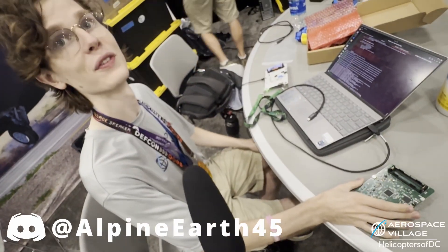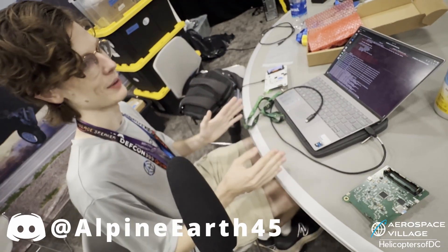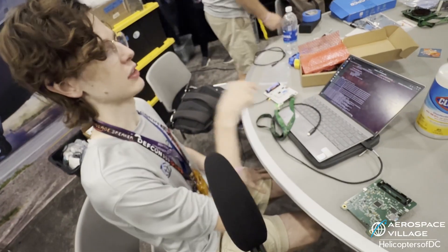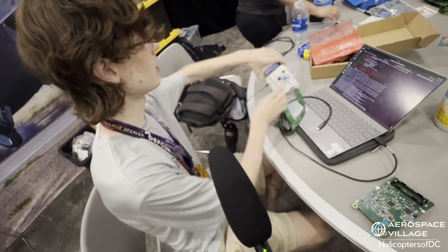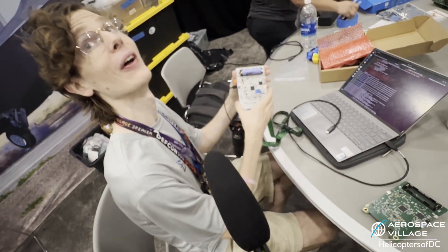We actually found the issue at DEF CON on the first day. We gave 2x the time we thought was needed for the boards to come in, and yet they still couldn't get even a hundred done. We had to fight to get those hundred into DEF CON. All the production boards except one — we call it the 'blessed board' — were assembled incorrectly, and we had to manually go in with a soldering iron on each one and retouch that single pin on the BMU.